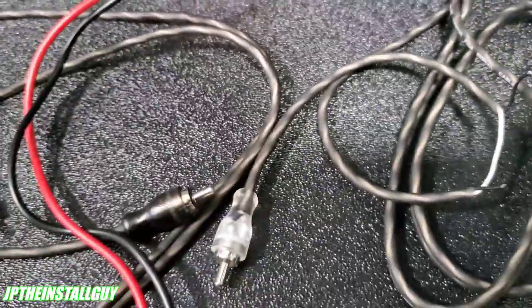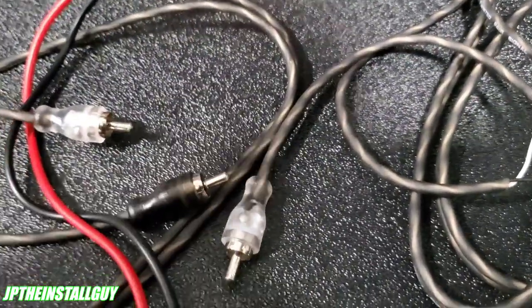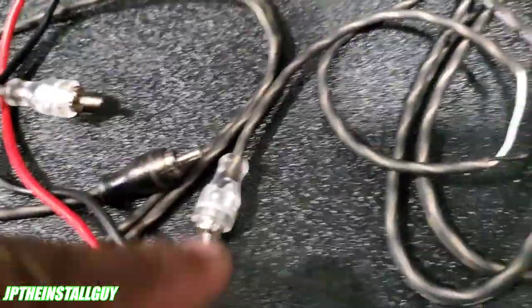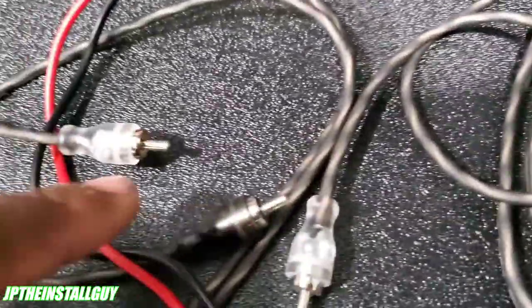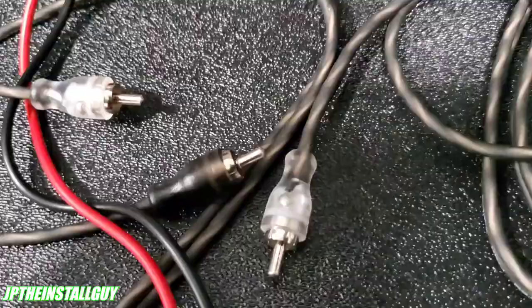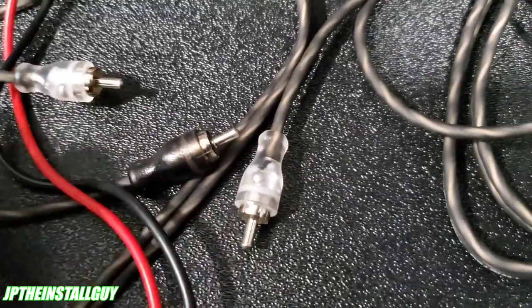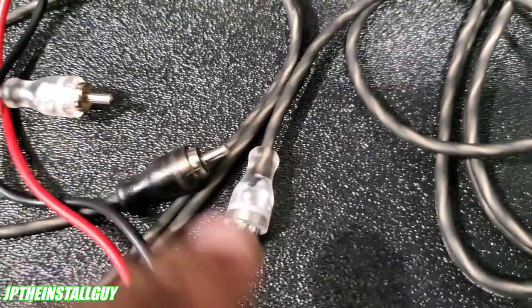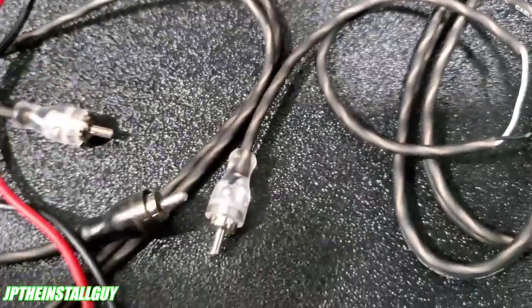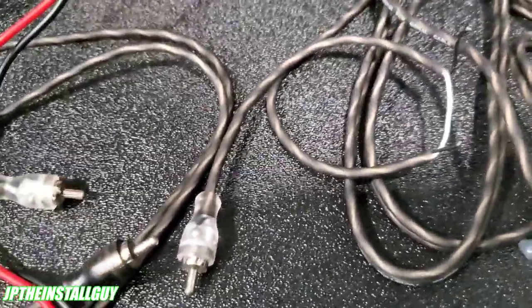There's the beep — so that's what happens when you have a bad RCA. You test tip-to-tip on the same color and you may or may not get continuity. Our tip-to-tip did not work because we have a break. So to summarize: measure tip-to-tip to make sure there's no break in the path, then measure shield-to-shield. Do that for both the white and the black — the left and the right RCA.